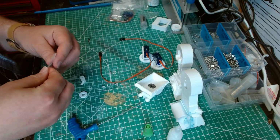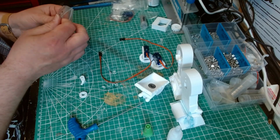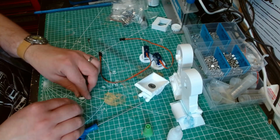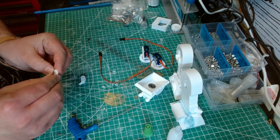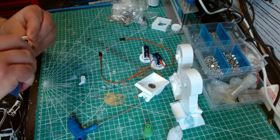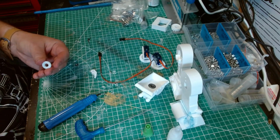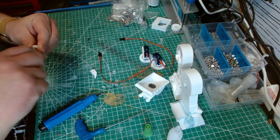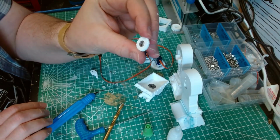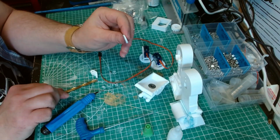So you need a 683 ZZ bearing, just a single one at this point. You will need 4 of these total. Add on those. And that's, obviously it doesn't fit. Five minutes later. There we go. As you saw, I pre-drilled the hole out. Well, after scraping it out, I used a 7mm drill bit, and that pushed in.